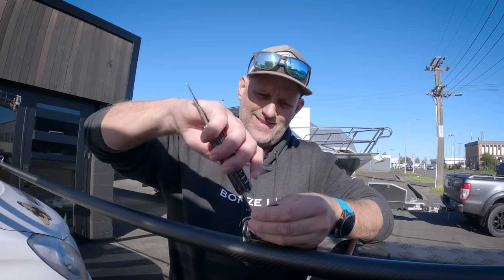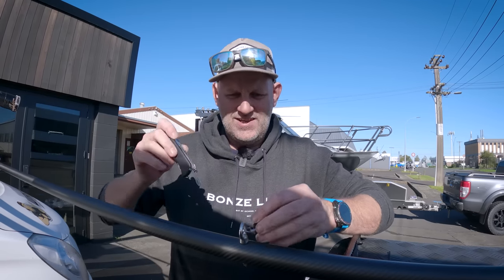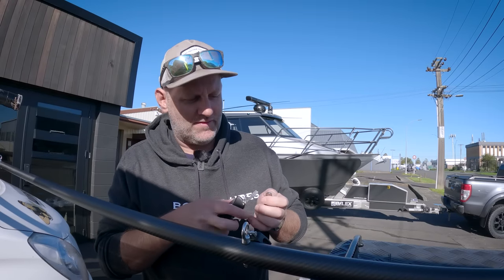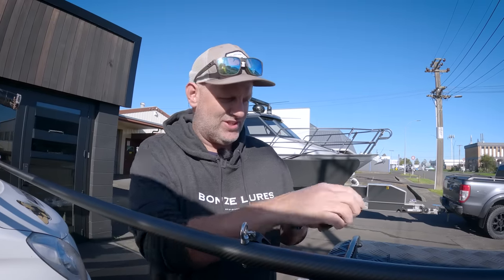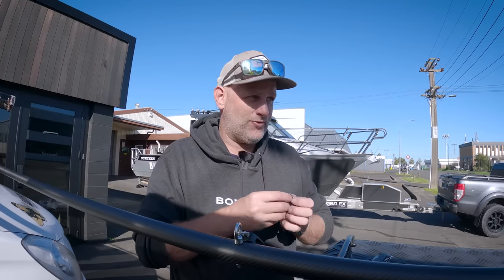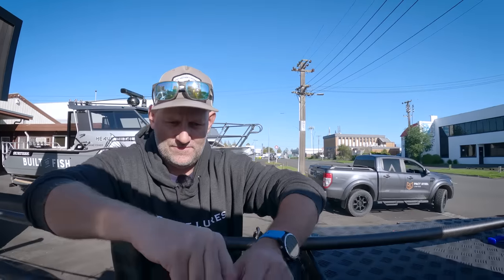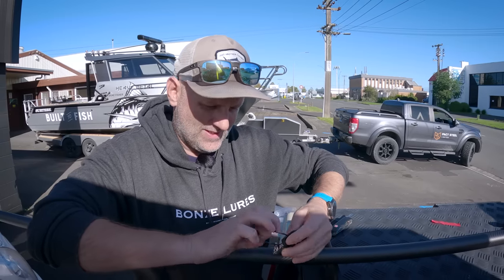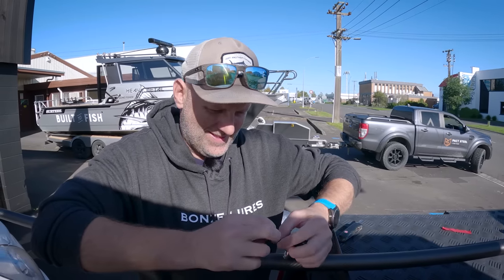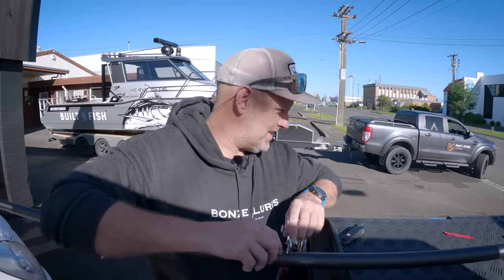So that's my short corner or long corner. Once we start putting the halyards on, it's worth noting that we're creating a starboard and a port rigger and you'll need to label them as such, because each outrigger is going to be designed specifically for that side of the boat. The reason for that will become clear as we rig up our halyards. It seems like a simple thing - putting these zip ties on to stop the pulleys twisting - but you'll thank me when you're at the boat ramp in the dark trying to untangle your halyards.